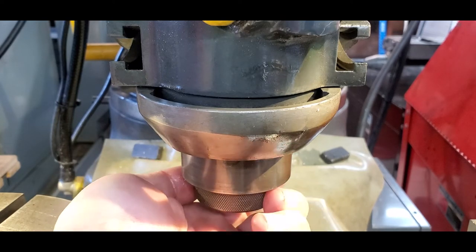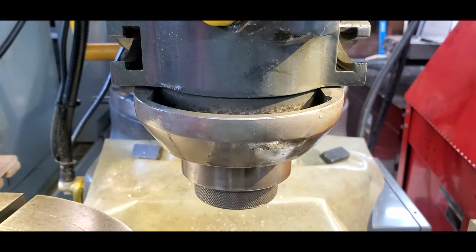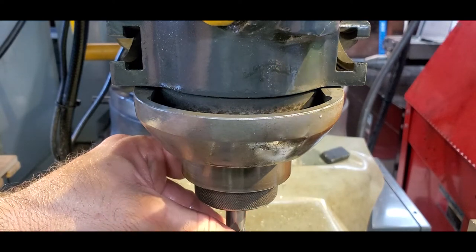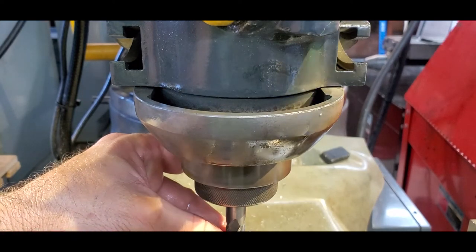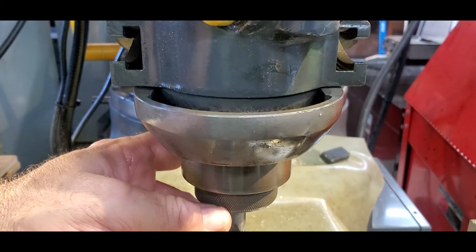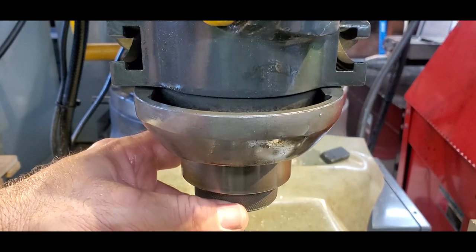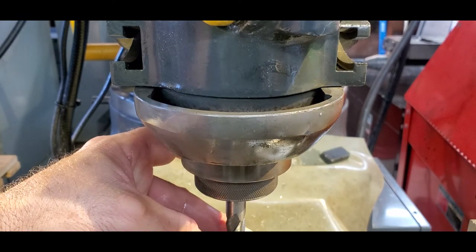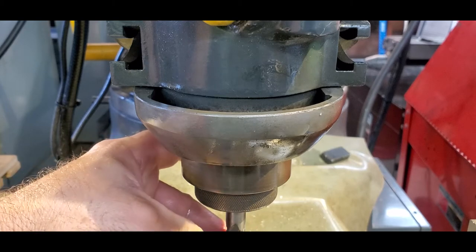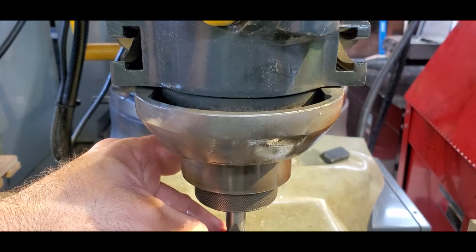With the yoke open a little, you pull down on the handle — it'll stop. That's opening the collet. Close the nut all the way until it's snug, back it off a little bit, then put your tool in — in this case an end mill. Put that in there, then you're going to push back on the handle. If you're not feeling it go over center it's too smooth — pull down on the handle, turn this a little tighter, push it back. Still no over-center: pull down, a little bit tighter, back on the handle — you can hear it closing the collet.